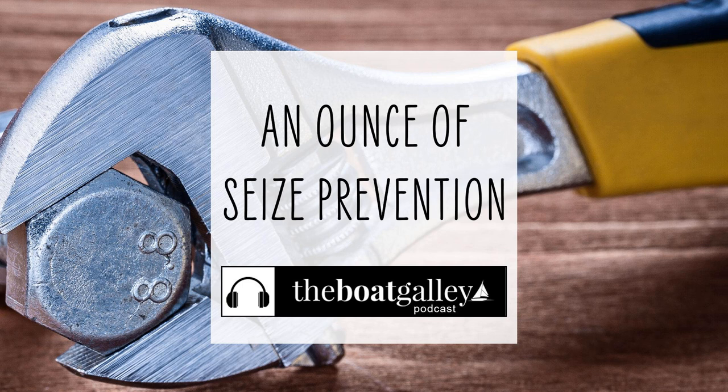Once you open a tube of this, you need to keep it in a heavy-duty freezer plastic bag or reusable silicone bag. If it just sits in the toolbox on a boat, other stuff will hit it and most likely puncture the tube or at least squish it, and you'll end up with this stuff everywhere — it does make kind of a mess. If it's in a bag, it's much less likely to puncture. And if it does, the mess is contained. Also, if it's in the bag, you can still just stick your finger in, get a little bit of the anti-seize out, and still use it. It's not wasted.